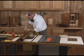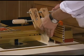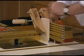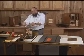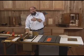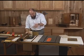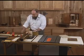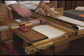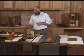It's worth pointing out that in your own shop, there aren't any situations where you're going to clamp in and cut just one of these tailboards at a time. Something you can't do with even the best conventional dovetail jigs is stack in a half a dozen, maybe ten of those tailboards and cut them at the same time. That's how an Incra system will be used literally in every project, and it gives you much better efficiency in bigger projects, like maybe doing a dozen drawers for a new set of kitchen cabinets.